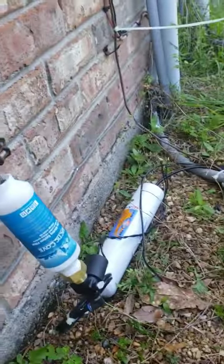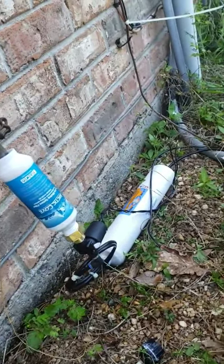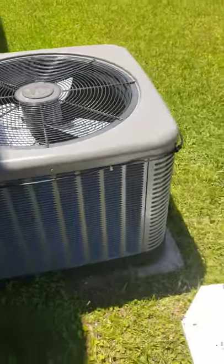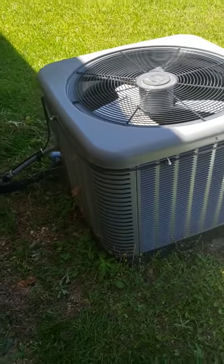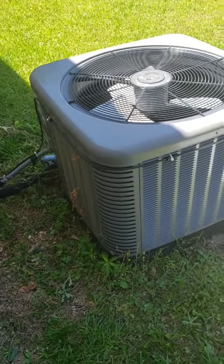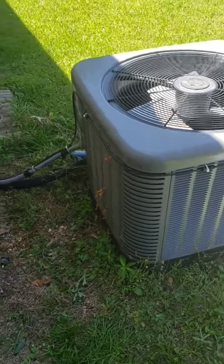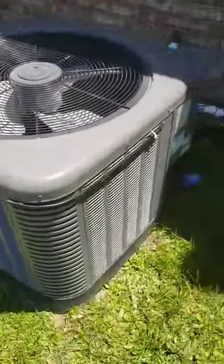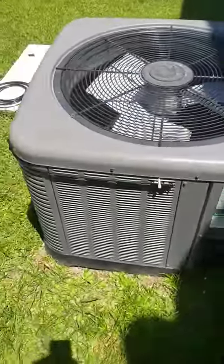My city water has 80 PSI, which is quite high, so it gives really good water flow. Adding three nozzles will cool about 580 BTU. I've got more than that, so this is almost a thousand BTU — I'm going to be completely efficient. It does work really well. If you watched any of my previous videos you'll see that. Thanks for watching.